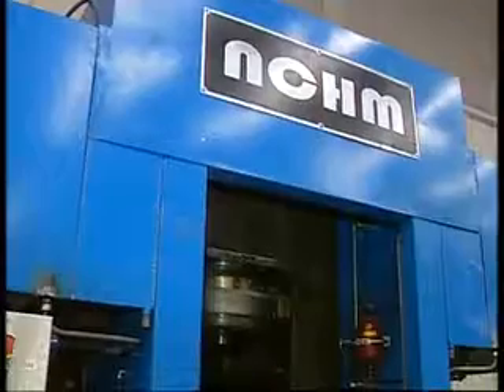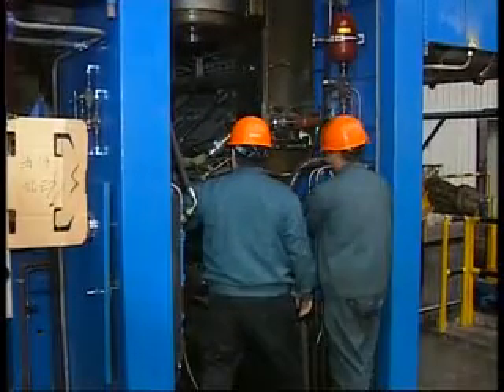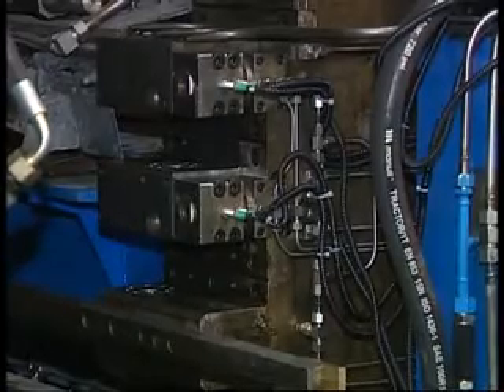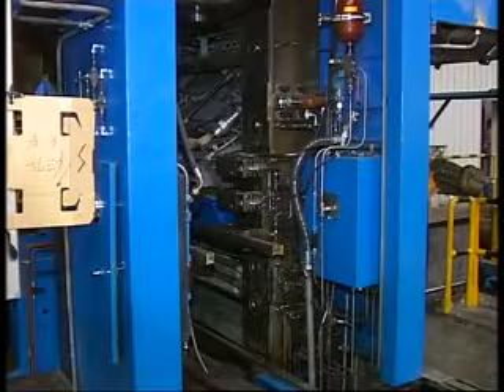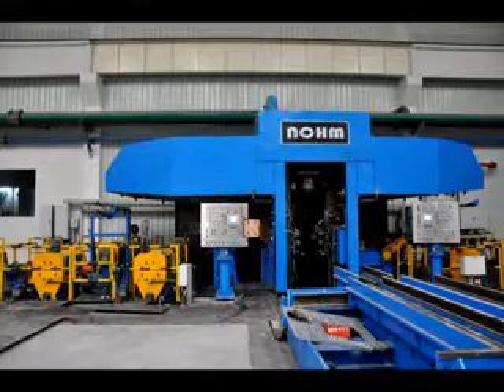The air floating threading system can be carried out quickly and conveniently so as to reduce the difficulty of operation. The back-up rolls and work rolls can be automatically corrected by the back-up roll correcting cylinder and work roll position cylinder, guaranteeing the position precision of the roll sets relative to the reference plane of the stand so as to effectively avoid product quality problems due to non-parallelism of the roll sets.